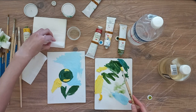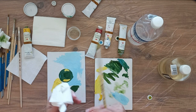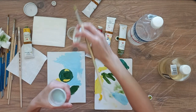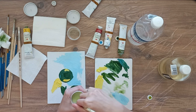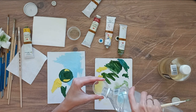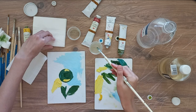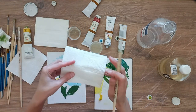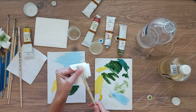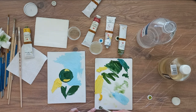I clean the brush again with the napkin. Now I will wash the brush at the end of the work. I wash it in the same dirty white spirit first — that is not a problem, the first washing is fine. Then I'll pour it out and pour a new one in and wash the brush again. The brush is clean. At the end of the work, all the brushes can be washed in one jar with white spirit, then washed a second time in a clean solvent. It is not necessary to pour clean solvent separately for each brush.